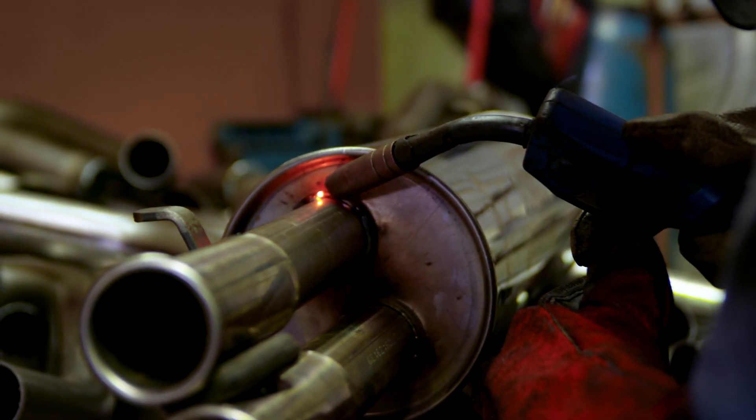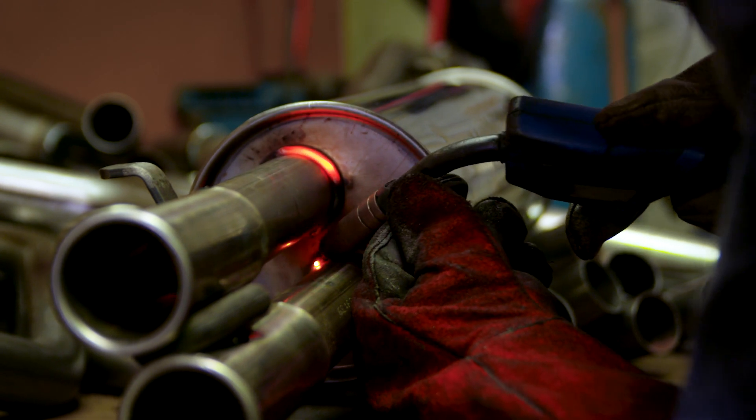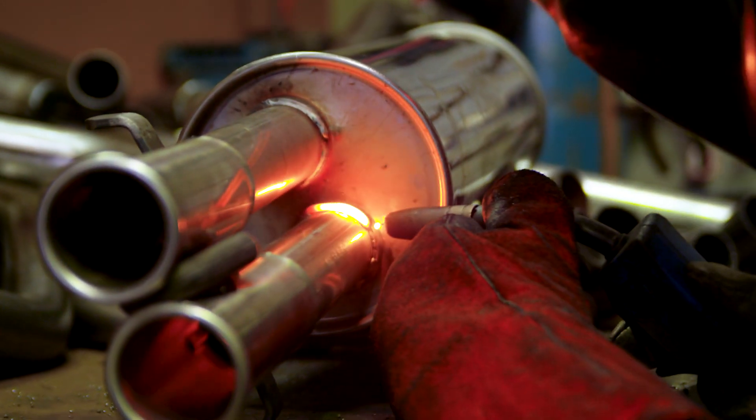It's important to practice both forehand and backhand welding, or push and pull techniques, which will be used across a variety of situations. While in operation, your weld should make a sizzling sound and the gun should travel smoothly without stabbing.